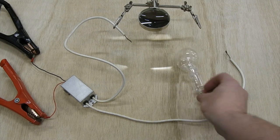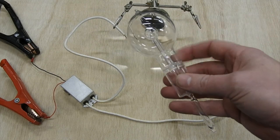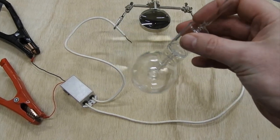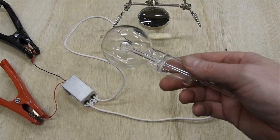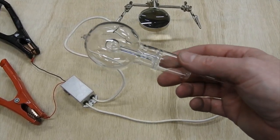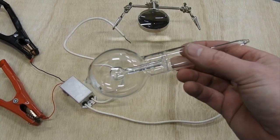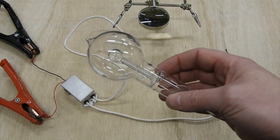The Tesla bulbs, we are looking to do some testing on these and show what they're capable of. You've got two envelopes. You've got the outer envelope, which is ultra high vacuum. You've got the inner bulb in the middle, which is basically ultra high vacuum, and then it's backfilled with the conducting gas, and that could be nitrogen, helium, neon, argon, xenon. Choice is yours. I mean, the jury's out on what the best conducting gas is. Tesla constantly talks about nitrogen in a lot of his work, so this one is backfilled with nitrogen.